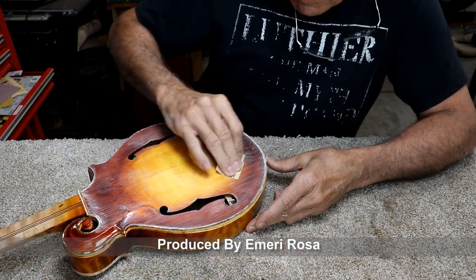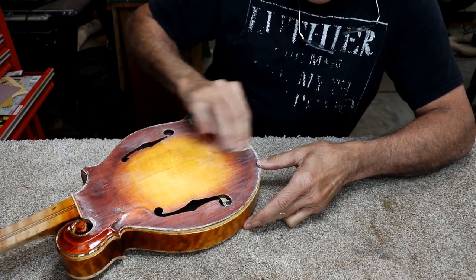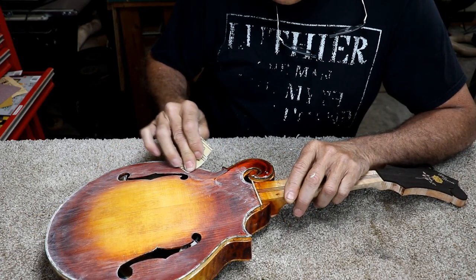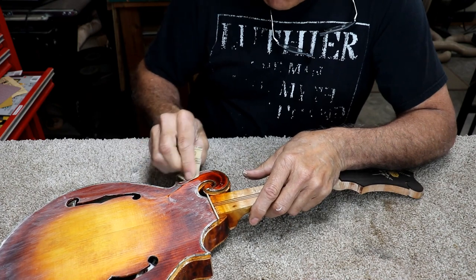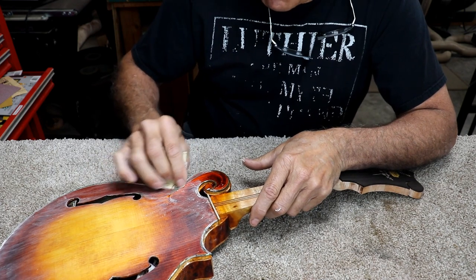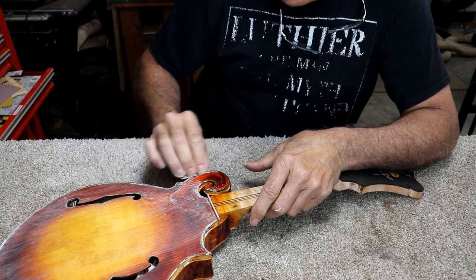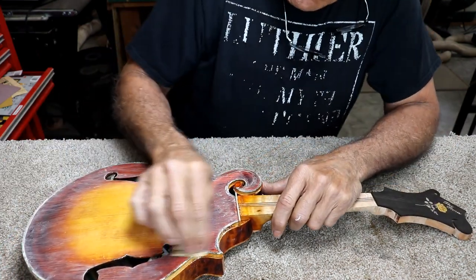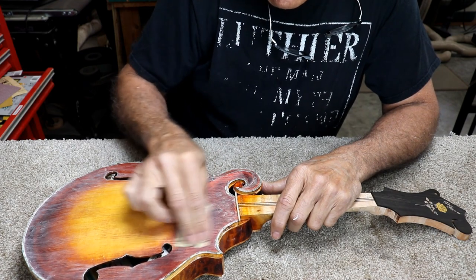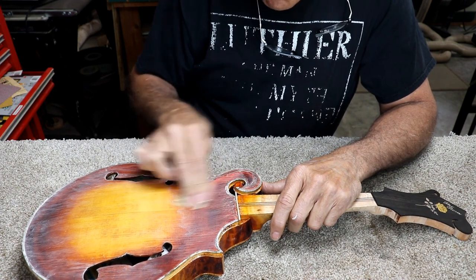Maybe I'm getting a break because this is the world's finest mandolin ever built by a human, right? In case you're wondering if it's something to do with the foundation below it — they're pretty much the same. It was bare wood covered with some leather dye, same on both. Right now when I wrap this shellac it mars the finish a little bit, so I need to get a harder finish on this, which I think the oil varnish will do.